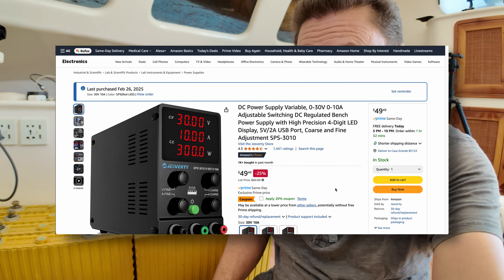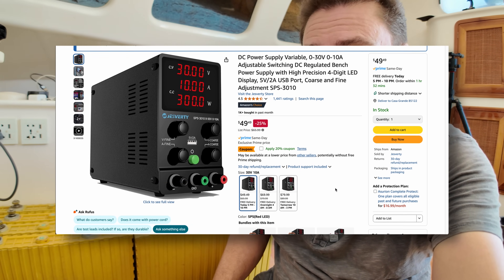I don't want to give up on the Winstons — at least I can recover them, charge them up, maybe sell them. I've bought a charger from Amazon, a 10-amp constant current charger. We can set it up at around 3.2 volts and do a top balance, which is what these packs need.